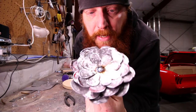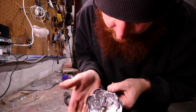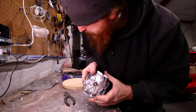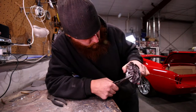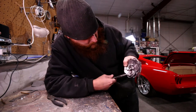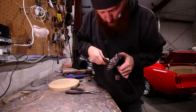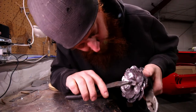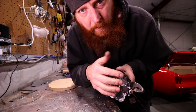I've got all four of those tacked and I've also tried to stagger my leaves a little bit so they weren't all four in one row — they kind of stagger out. Now we'll just take a pair of pliers and start bending. Be careful not to tweak those things back and forth so much that it starts to rip the inside and one of the leaves falls off. If it does, just open it back up, weld it, and put it back together.